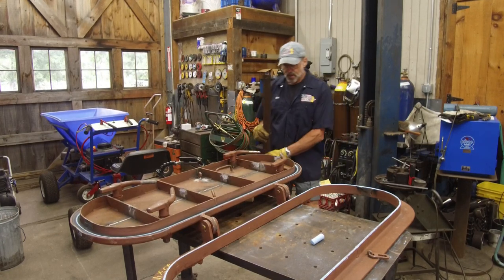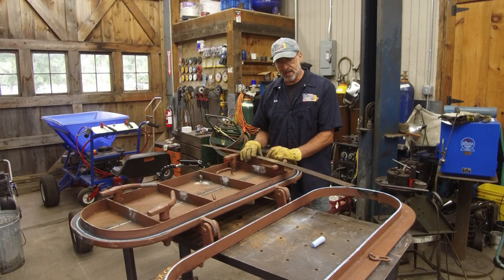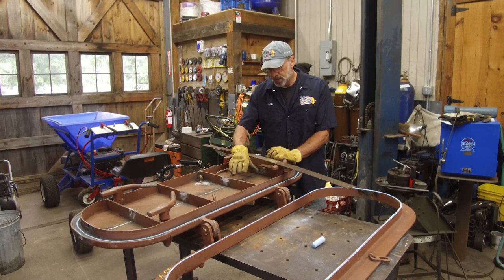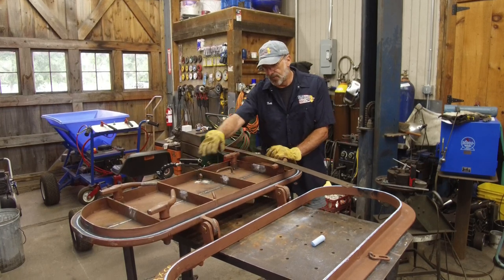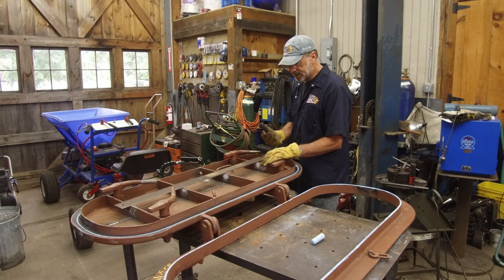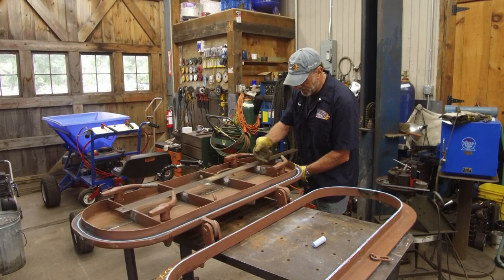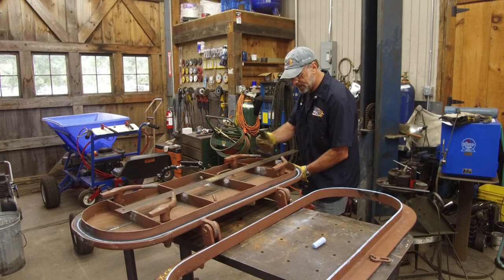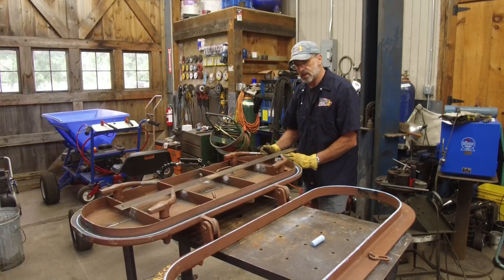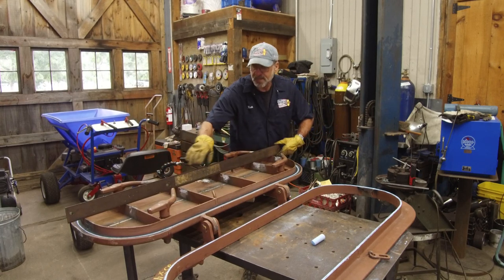Okay, here it is. One thing I wanted to talk about is I did weld on that knife edge to bring it up for the final contact. But this hatch itself, or the bulkhead door itself, was warped pretty good from all the welding. Without the dogs on here, I was able to put this in the hydraulic press, and I blocked under this rib and under the outside lip out here, because the bend was focused at this last rib right here. I was flat surface contacting on both sides here, and as soon as I got here, this was pulling away a quarter to 5/16 of an inch. I was able to see that across the surfaces right here.